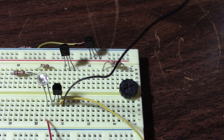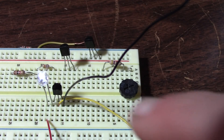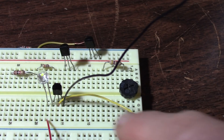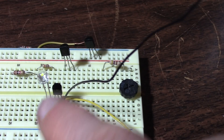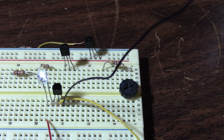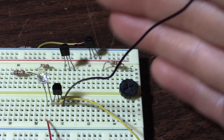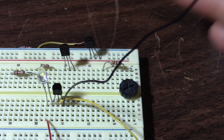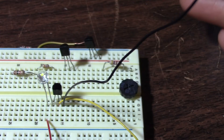Last but not least, I'll show you how sensitive this device is. I just have the LED connected to the drain and then sourced to the negative, with this wire as an antenna. When I bring my hand near it, you can see that it turns on. There's a lot of stray electrical noise from the mains, and it's picking it up — that's just because it's a very high impedance input.